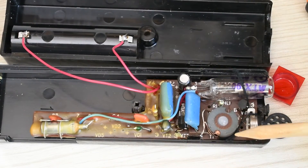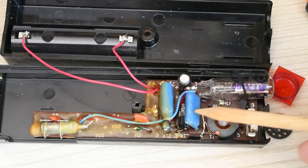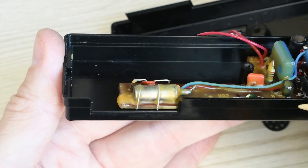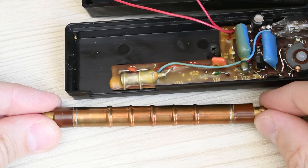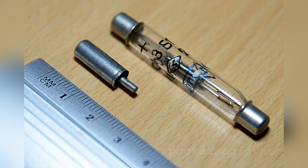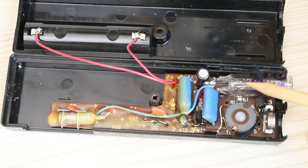Inside there is a small circuit board with components. As we can see, the device's circuit is quite simple: it has a power supply circuit based on transistors, a step-up transformer, and a voltage multiplier using a diode and capacitor. The SBM-21 counter itself is tiny — its active length is only 16 mm and diameter 6 mm, which is why it has low sensitivity. For comparison, here is an SBM-20. The SBM-21 is designed to register hard gamma and beta radiation. Impulses from the counter go directly to the indicator thyratron MTX-90 and a piezoelectric sound emitter. Let's use the device in the dark to see how beautifully the thyratron flashes.